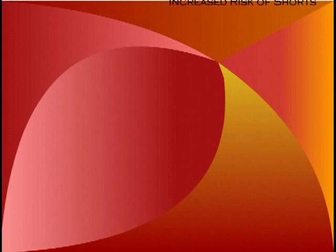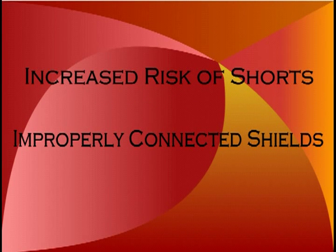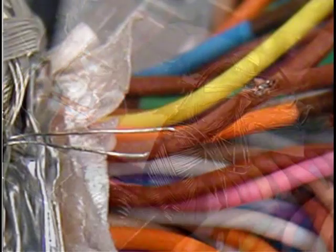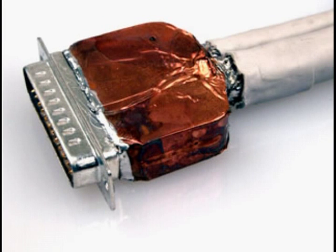The two main quality problems with shielded cables are the increased likelihood of shorts due to exposed foil or metal fragments, and the need to assure that all shields are in place and appropriately connected. Shielded cables have an increased risk of shorts due to stray metal strands of braiding, inner wires that are nicked when removing jacketing, or exposed foil in overmolded cables.